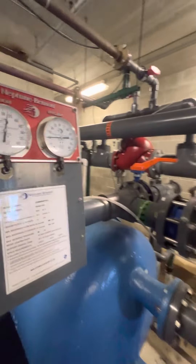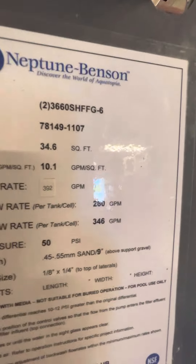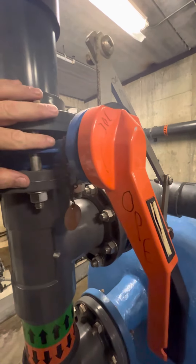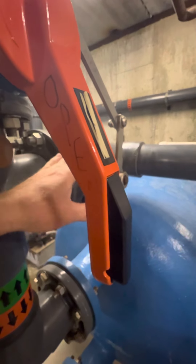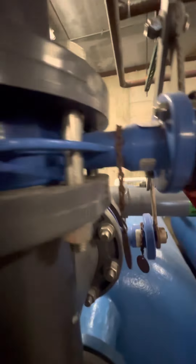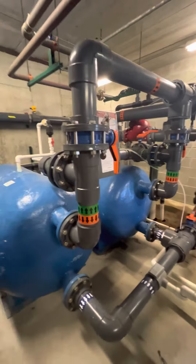This manufacturer wants a powered backwash — they want 260 GPM minimum flow rate. To initiate a backwash, these valve positions get changed. We close off the pump flow and we open up this valve, which allows the backwash to flow out to drain, which is over there. Here's the problem: there's no piping that allows me to change the flow direction.